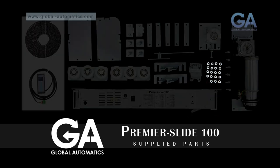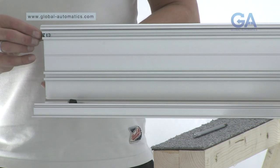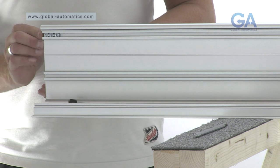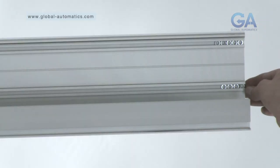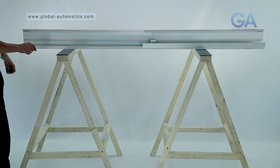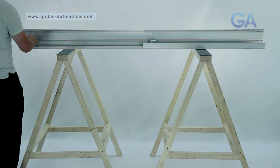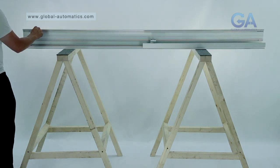Select the required amount of nuts — this will vary depending on the operator length. Slide them into place on the inner rails of the sliding door track. There should always be two extra bolts on the top left and one extra bolt on the top right. Roughly space the bolts as shown. Each strap will require two: one at the top and one at the bottom.